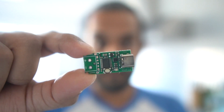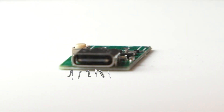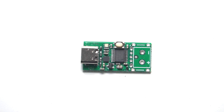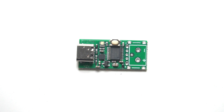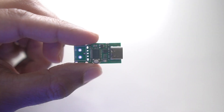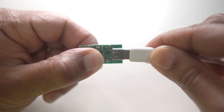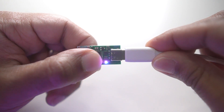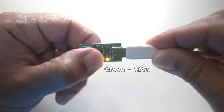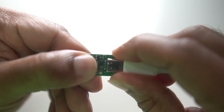All we need is one of these. The ZY12PDN USB-C trigger board is probably the most well-known of these boards, so I've put a link in the description if you want one. But how does it work? Plug your USB-C cable in here, power comes out here. Use this button to tell the charger what voltage to ask for. To set the default voltage, press and hold the button, then plug in the USB-C power. Tap the button until you get the voltage you're after, then hold the button down to save your choice. That's it.